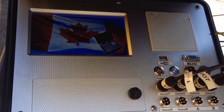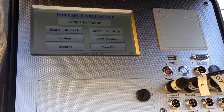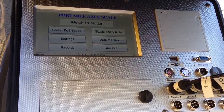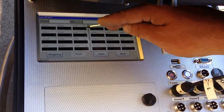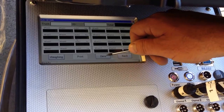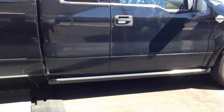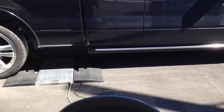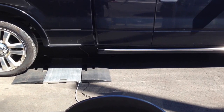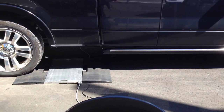She's booted up. Here's your printer here. We are weighing static, full truck. Sometimes these numbers are a little off depending on if your scales have been bumped or not, so always set it to zero first. Then you simply drive onto the platforms.